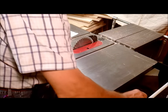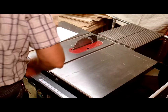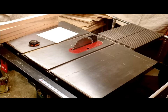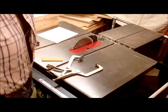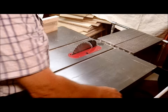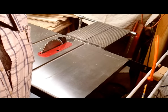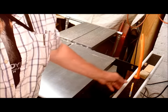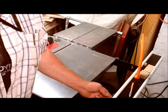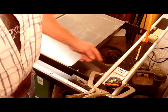There - that gets me 27 and a half, it looks like. I'll take this little piece of plywood, set it on here for my mark - I won't be running against my stop fence or my rip fence. Please forgive all the garbage in the background. I've taken my rip fence, put a small piece of plywood on it with a clamp as a stop so I can get my 27 and a half.